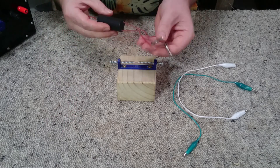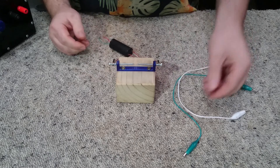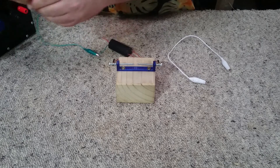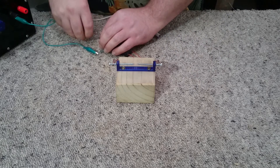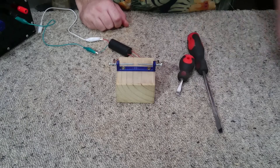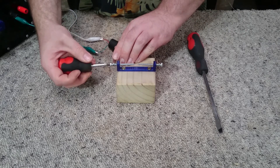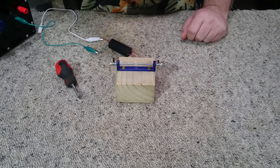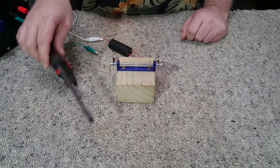I've temporarily put a couple of alligator clips on the output terminals of the transformer. You'll preferably want a couple of alligator jumpers to hook up the input wires to your lab power supply or battery, whatever you're using to power the transformer. I'm also going to use a couple of screwdrivers — one to adjust the spark gap distance, and a long-handled insulated screwdriver to bridge and short out the gap to make sure there's no residual energy stored in the transformer.